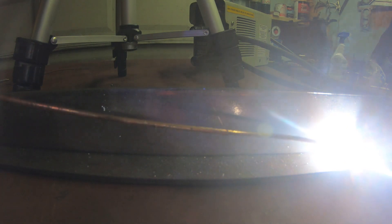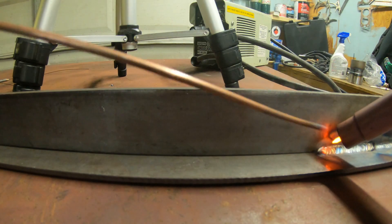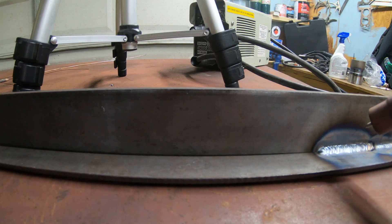Typically, if I had enough amperage I would try to do a single dab, but in this situation with a low heat output, I'm doing a dab and then working it from the bottom to the top of the joint — just making a decent tie-in at the base. And we just tripped a breaker.